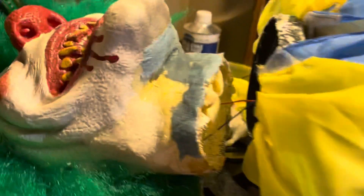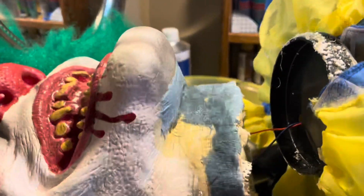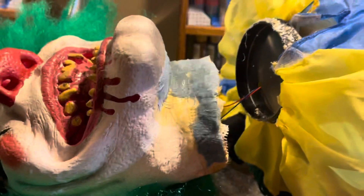The first thing I did was wipe it all down with the highest grade alcohol I could find at 91%. Then I took some fiberglass mesh and meshed the insides and the outside — the inside was meshed with the caulk, the outside is meshed with contact cement. You let that dry for the time it says, then coat it on to make it structurally sound. This whole side has been hit with it and it's going to probably help it a lot. Then what I'm currently doing is taking blue shop towels and coating over the mesh to make it smooth.